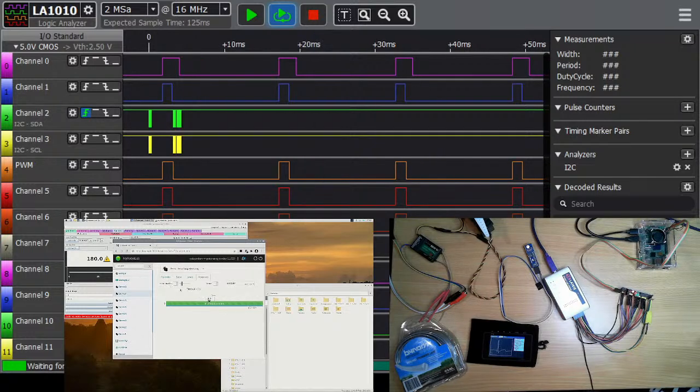Now, normally you would leave that auto disable turned on. By default, it is on, although the display doesn't appear to be showing that. That way you don't leave a control signal on a servo where it doesn't need to be running, and you don't burn out your servo. A little bit of a caveat: if you're running the InMoov robot, the omoplate you do need to leave on, because when you lift the arm up, if you turn it off, the arm will fall under gravity. Something we may need to look at in the program is turning it off when we're not actually using it.